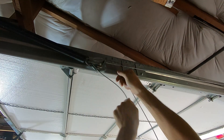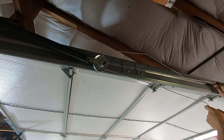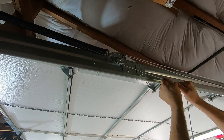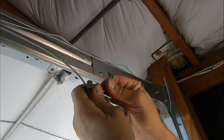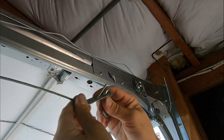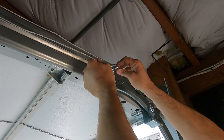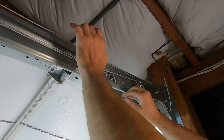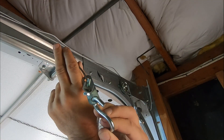Coming back through this pulley and then we go forward around that pulley. Now we can put a little bit of tension on it when we hook it up to that S-hook. You can see how I have it just weaved through there. I'll loosen this up just like that, and then that little clamp goes on the end to make sure it doesn't pull through. I just wanted to check the spring tension — it's not bad, hardly any spring tension on there. This goes on here like that and then we tighten that down — close-up — tightened so that cable is flattened out.